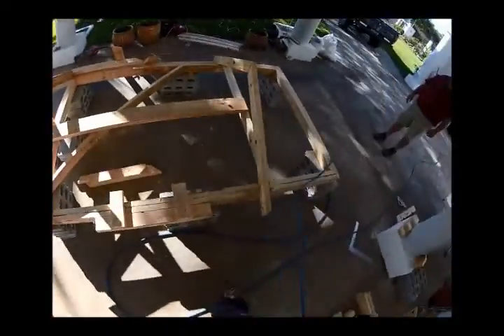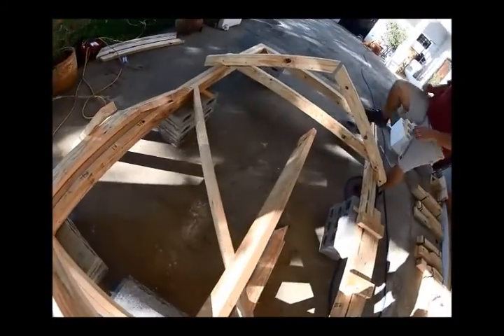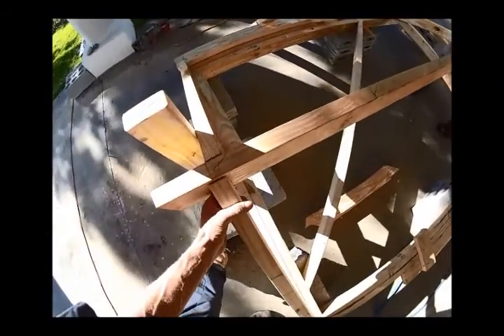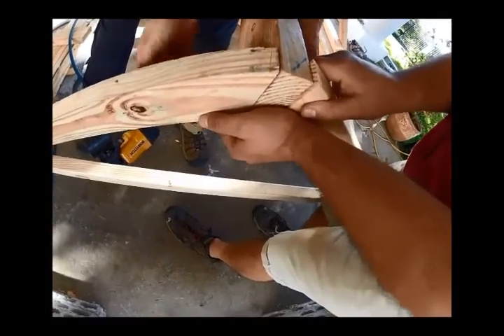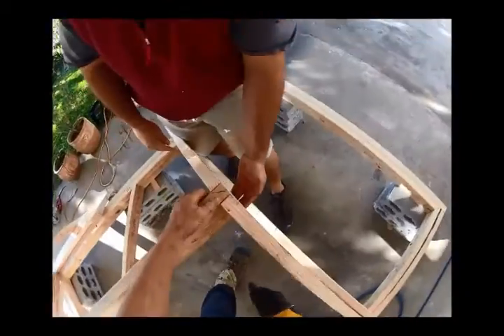I'm going to go ahead and raise this ridge up — got my layout marks. Ron, you want to just grab that in there, raise it up for me, right in between. I'm going to kick a nail in this guy right where the outside is. I'll let that go, come back, straighten that. What you've got to do — just don't pound, never pound, just open the two up, because you'll typically just pound out the bird's mouth when you're trying to level them out.